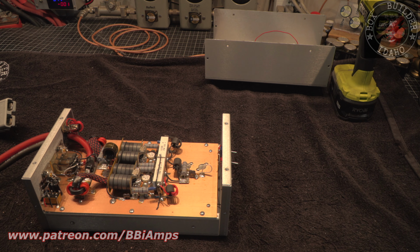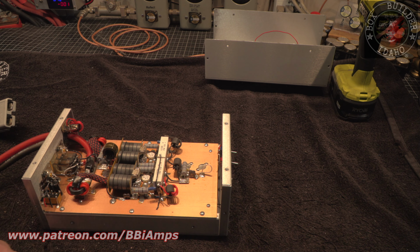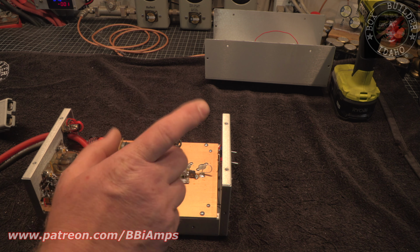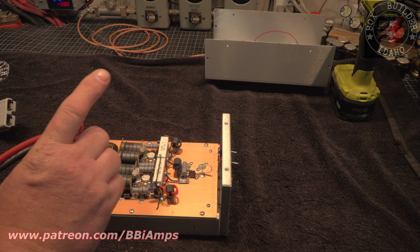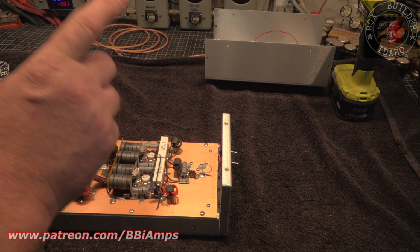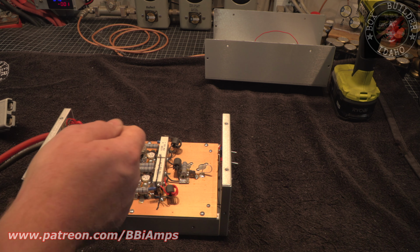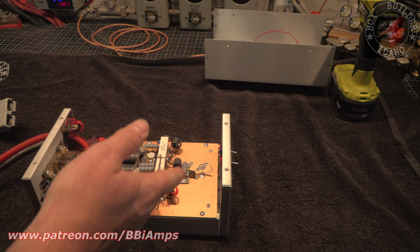This guy had a little bit of an oopsie. He was sitting and running this thing on his base, apparently. He switched antennas, and when he did that, he went to an antenna that wasn't hooked up. The switch wasn't hooked up, something wasn't hooked up. Keyed it up, and it popped a transistor, and he immediately saw it when he keyed up. When he figured out he didn't have the antenna hooked up, he went back and tried it.